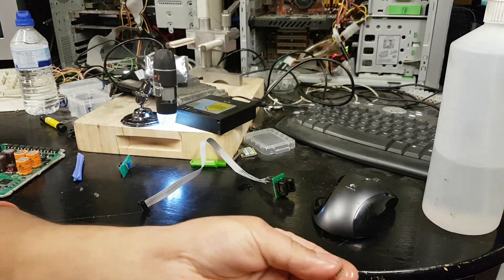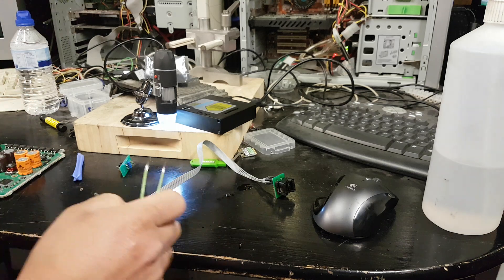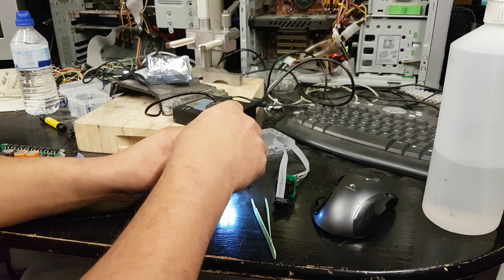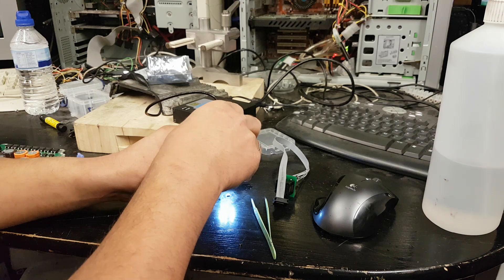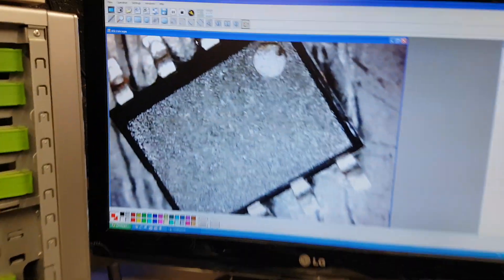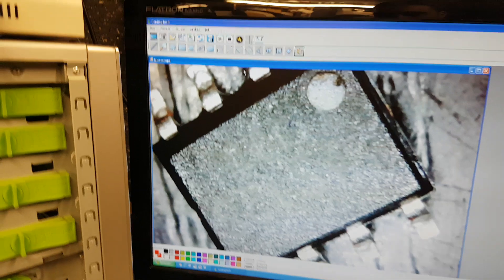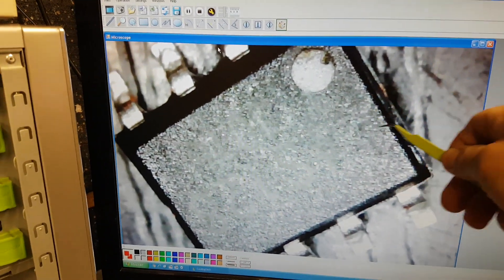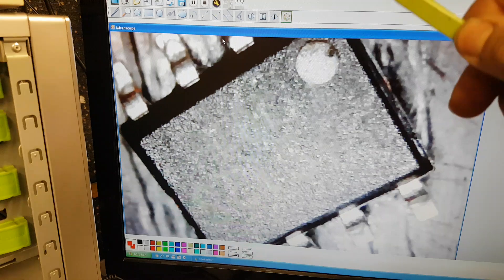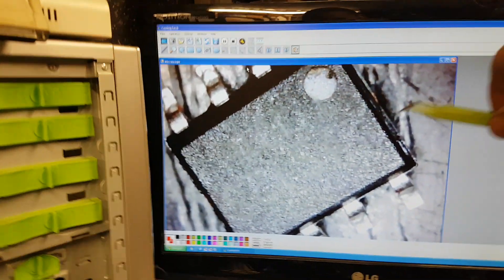I keep being asked which pin is pin number one. I'm going to put it under the microscope so you can actually see it. A lot of chips have a small dot on one of the corners — that dot indicates pin number one. Some other chips have a linear mark in the middle, which means you place that mark to your left-hand side and pin number one is going to be the pin on the underside underneath.